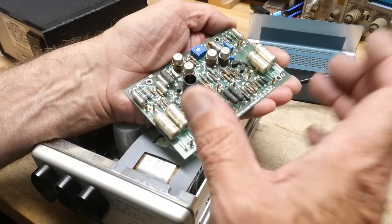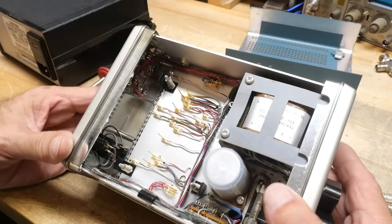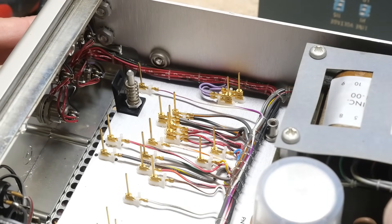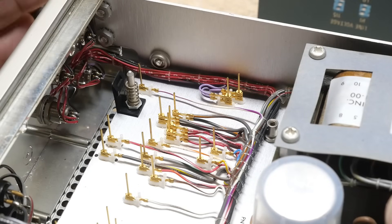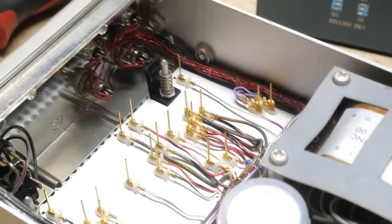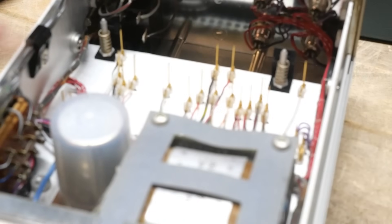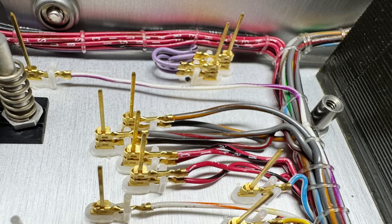I was thinking there's a board underneath that this matches to — nope. What's underneath is insanity. This is the most insane thing I've ever seen inside a product. It's all these little gold posts that just magically appear in the right places. This little plastic bit holds them in location, and gold pins stick up. Wires come in that are crimped onto gold little things that slide onto there and make contact. It's all gold-to-gold — there's no solder involved.